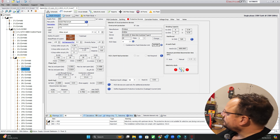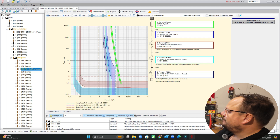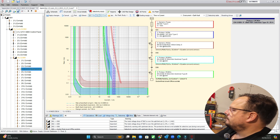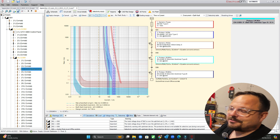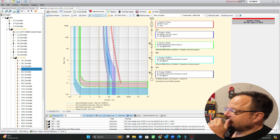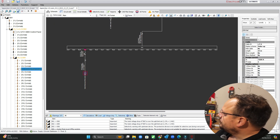You can see we've got some selectivity issues now — this is to be expected just because of the environment I've got here. I've got RCDs stacked up in series, I've got varied values of MCBs. So you can see we've got the 100A generic fuses, then a 40A sub-main through an RCD, then a 32A sub-main leading off to the board, and a 20A final circuit on the sockets. With MCBs in particular the overlap on the tripping curves — as I've demonstrated in videos before — means on a short circuit fault, basically all bets are off. In a real-world environment we'd be looking to utilise fuses; we wouldn't have so many RCDs in this installation anyway. It's a training space so we're trying to be super cautious.